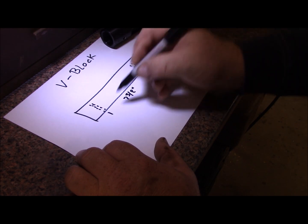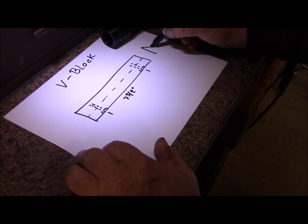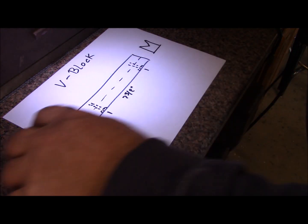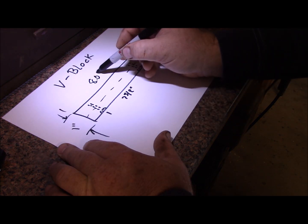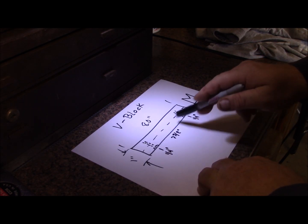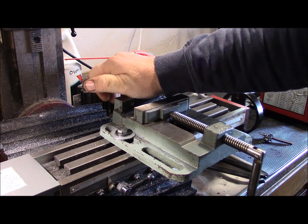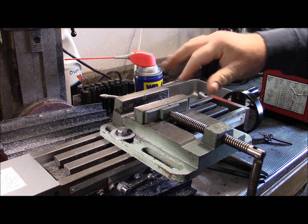These will be counter-bored. We're probably going to go about half deep on our notch. The end will be about one and three-eighths, so if we go one inch I think we'll have plenty of clearance, and one inch tall. These two holes would be quarter-inch drilled all the way through. I'm going to square this up and do those first, then I'll mill my slot. I'll drill my holes quarter inch and counter-bore those for the allen head screw.